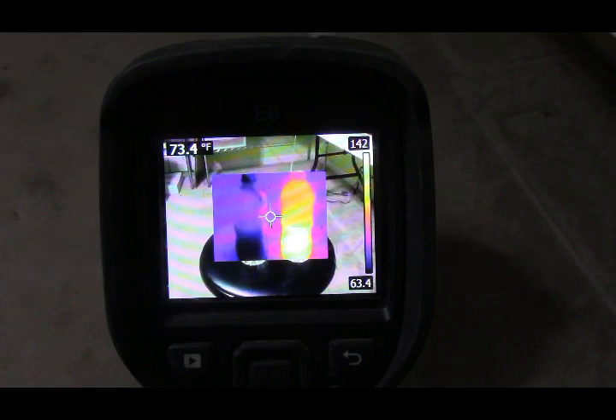Hopefully you'll believe your eyes. If you want to replace the cover on your laser with just a sheet of clear, yes you can do that. Would I do it? No — because that colored acrylic is also blocking some of the bright light that comes through when you're watching where the laser is cutting. I always wear tinted glasses because that light is very bright right where it's cutting, and it's going to affect your eyes just like staring at the sun. That bright light is going to bother you — that's why you see stars afterwards. So there you are, in a nutshell: infrared does not pass through acrylic. Have a great day.